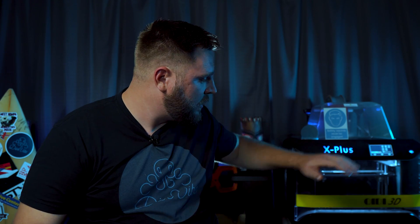But I wanted more — nylon and polycarbonate. That meant I needed a high temperature extruder, a high temperature bed, and an enclosure to control the ambient temperature around the print. After weeks of exploring various 3D printer models, I kept coming back to a Reddit recommendation: the Qidi X Plus. It's designed to handle beefy and demanding filaments right out of the box. So far I'm a huge fan. I'm definitely going to do a review on it, and probably a lessons-learned video to help you avoid all the mistakes I made along the way.